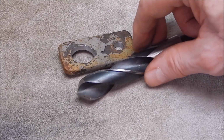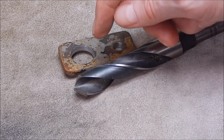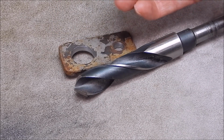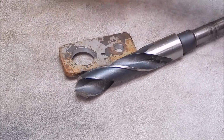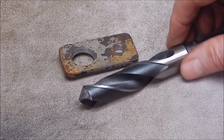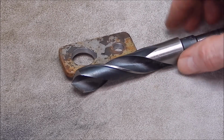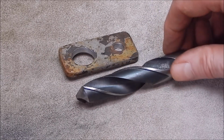To freshen up drills, as I said, you can grind the profile on the lathe and then grind the back relief and then do that by hand and then do the final finish off. And if there's any unevenness in the back relief, it's not really going to matter because this will dress it up 100%.